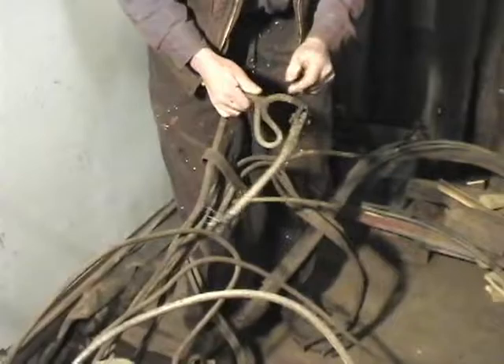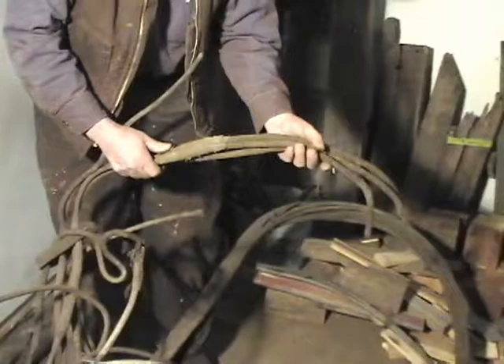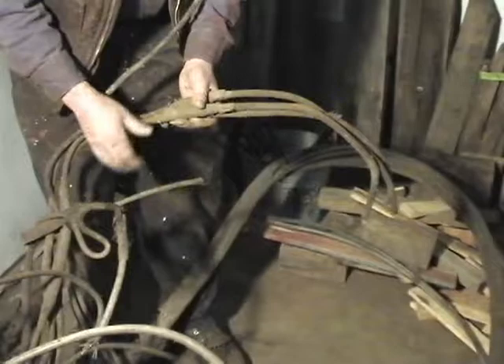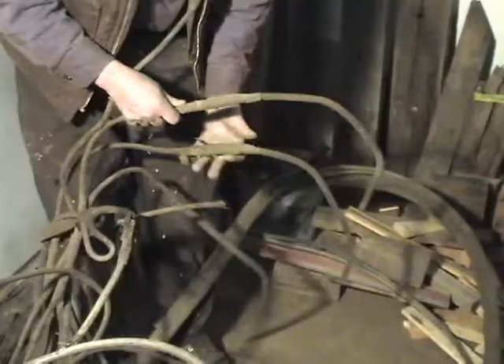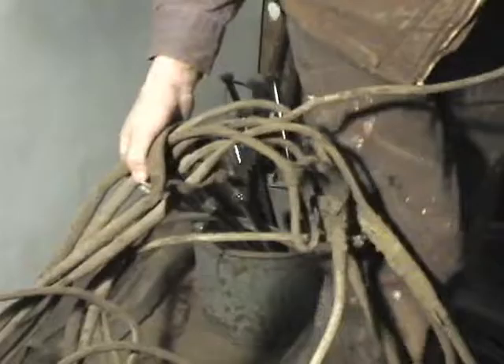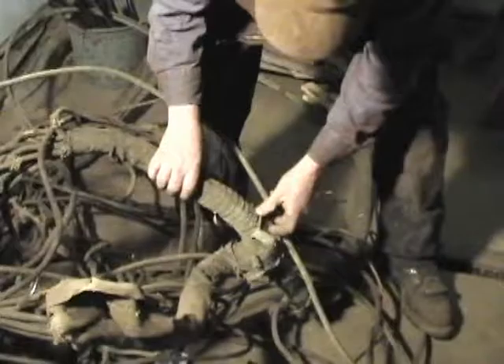I do nowadays put vinyl tape over first, but what you see will be friction tape on all these joints, just as they were originally. For some reason they put this kink in here and held it together with friction tape — I have no idea why. Here are a bunch of other splices where they lengthened the wire out for some reason. There may be just a bronze tube soldered together, or they may have wrapped the wire around each other. The wire was bundled either wrapped in friction tape or with hose put around it — there's probably cambric tape underneath.